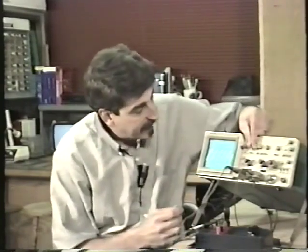Well, say for example you're a manufacturer working on the same piece of equipment all the time, and there's something that you have to set to be exactly, let's say, 1, 2, 3 main divisions and 3 subdivisions. You have to make something that tall. Let's say I'm on half a volt here. Let's say that's half a volt, 1 volt, 1.5, like 1 3/4 volts or so. That's kind of difficult. Like I said, with the oscilloscope, voltage measurements aren't all that accurate. So you go, well, it's about 1 3/4 volts.